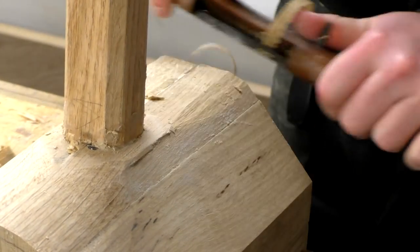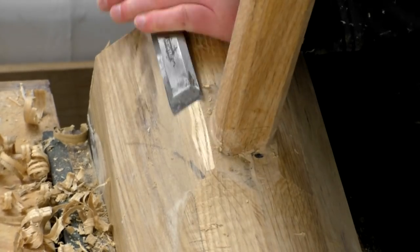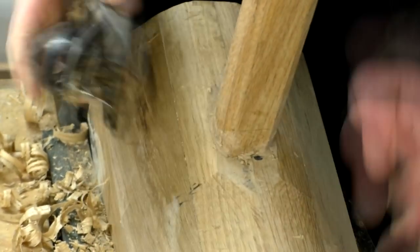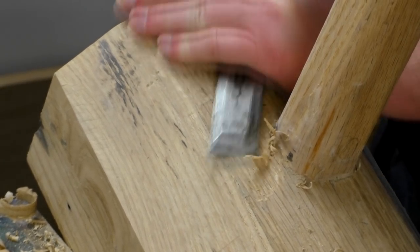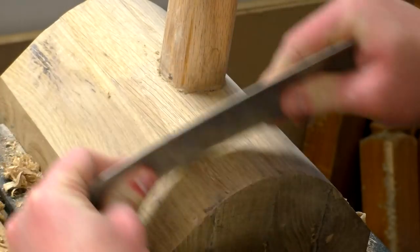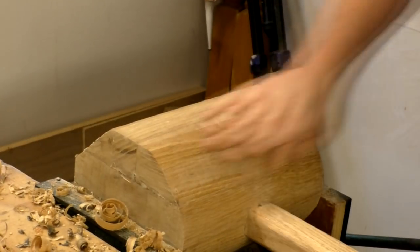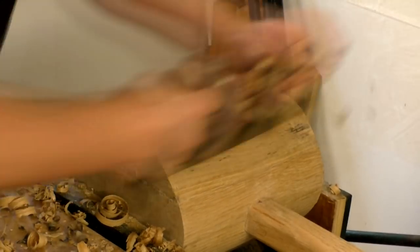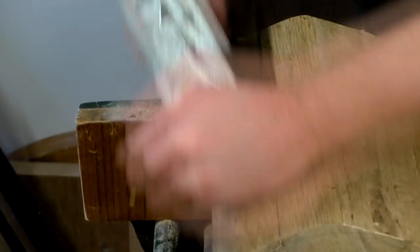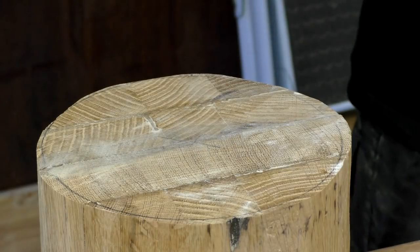Next I could start shaping the head. At the bottom I used a spokeshave, but because the handle was now fitted I also used some chisels and a block plane to work around it. I also used a card scraper just to get everything nice and smooth. For the rest of the head I mainly used my number 4 hand plane. Here you can see the spline joint being cleaned up and it looked really nice, creating a nice big pile of shavings. To clean up the ends of the head I used my belt sander, which worked really well — I think I was using 80 grit paper.